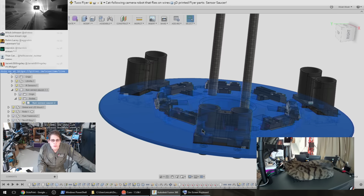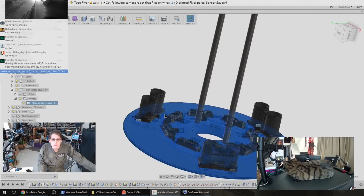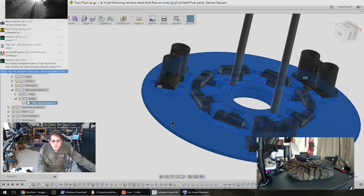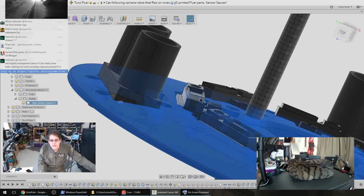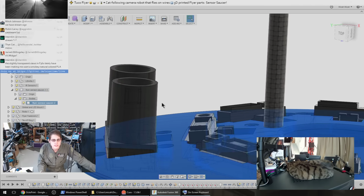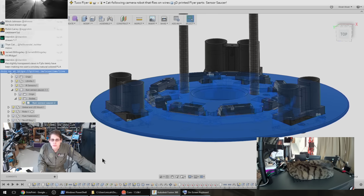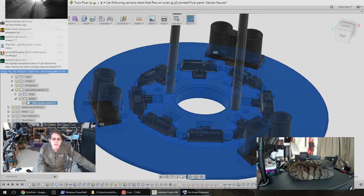So there are a few things I'm worried about. I'm worried about these detecting the gimbal itself. I'm worried about them not being sensitive enough at this distance. I'm a little worried about this IR sensor getting a reflection off of the barrel of this LiDAR sensor, things like that. I've tried to do some testing so far that makes it look like these problems are probably fine the way I've designed this, but those still are the most risky aspects of the design right now.